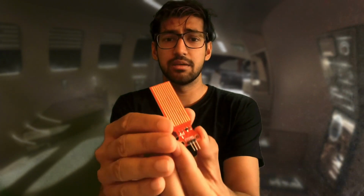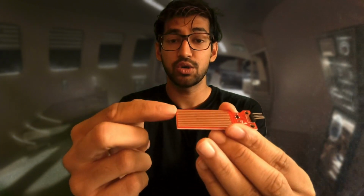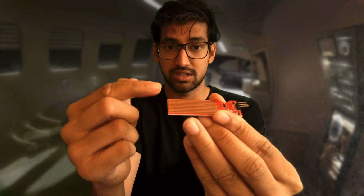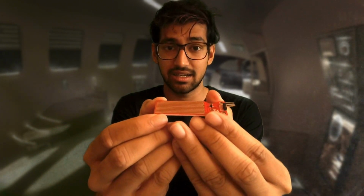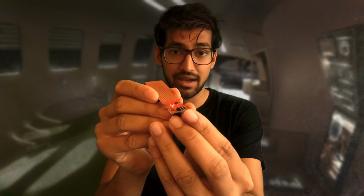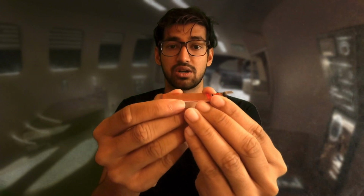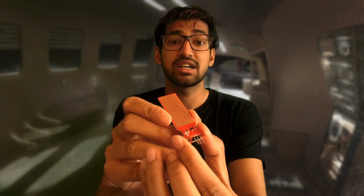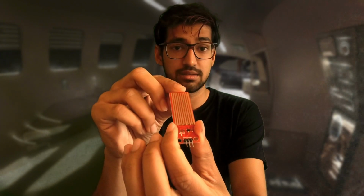What happens is, the moment a drop of water falls onto the sensor pad or onto these long contact points, a small current flows across them. As they are normally insulated and as water is conducting, this small current value is registered by the analog pin from the sensor output, and the microcontroller converts this analog output into a numerical value. This numerical value then corresponds to the amount of water which is present on your sensor pad.